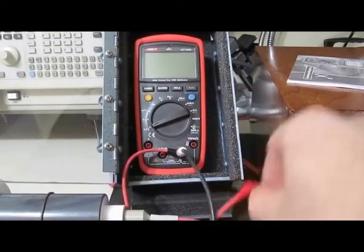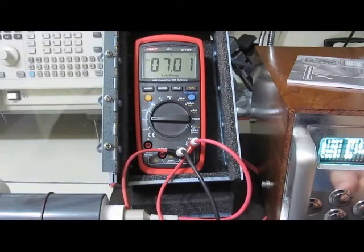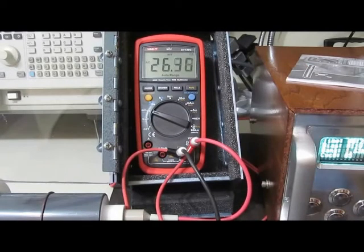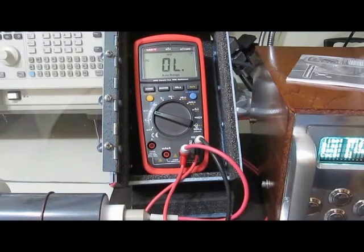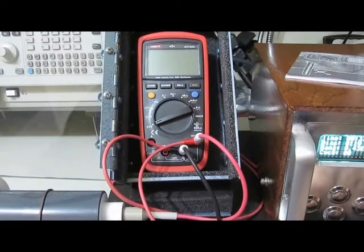So next up, 2000 volts, 100 microsecond full width, half height, 2 ohm source impedance, 5 transients each, positive and negative per mode. Okay, we'll go ahead and functional test it. Okay, the meter held up just fine. This next test will be 2.5 kV.